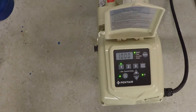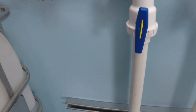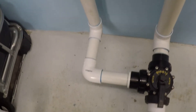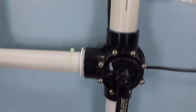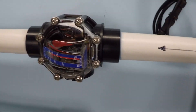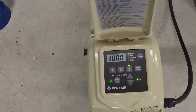Right now the pump is just idling at 1,000 RPM. Over here we have the two inch side isolated, so we're drawing from the inch and a half. The plumbing arrangements are very similar — negligibly different. Right now we're dialed in for inch and a half: we run through the pump, through the filter, two inch up until this Jandy diverter valve. The two inch side is isolated and we're running through the inch and a half side only. We're going to monitor our flow rate with the FlowViz flow meter. So we're going to dial it up to 3,000 RPM.